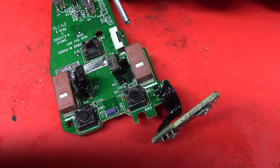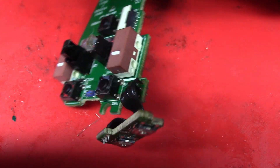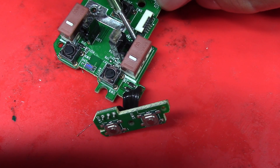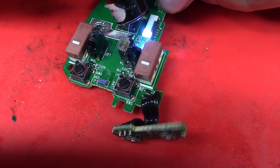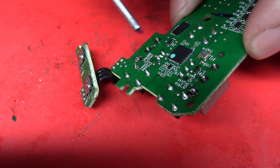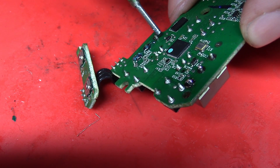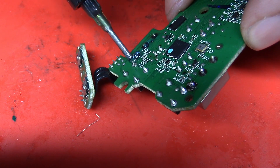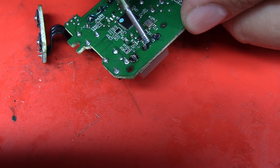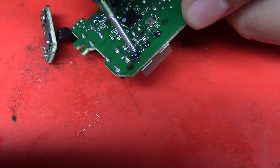We're missing a good chunk of support for this switch as well. I'm going to add a little bit of electronics glue right there — we have the ground pad up front holding it down, so just a little in the back wouldn't hurt. For the bottom I'm going to put some more glue right over all those pads and exposed wires — not so much for support, but for preventative maintenance. You don't want any chance of corrosion, and with these holes being so blown open it's a real possibility, so I'm going to protect it now.